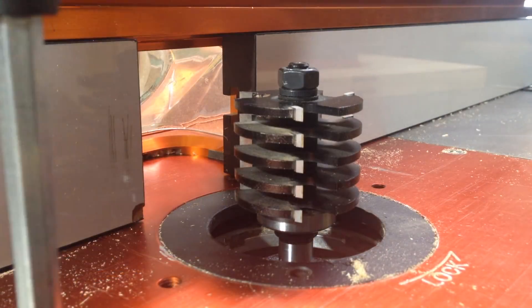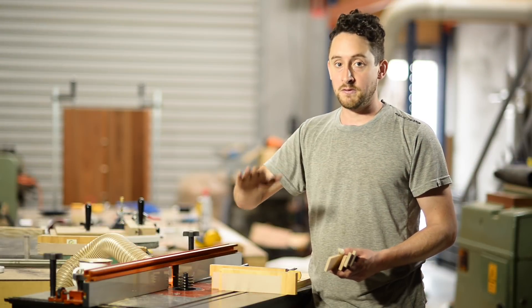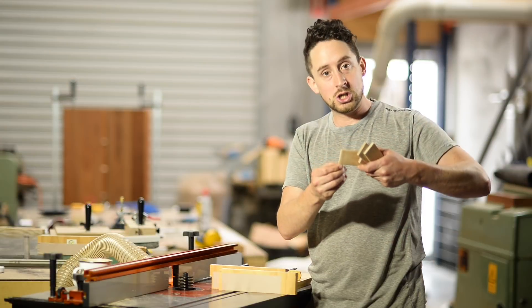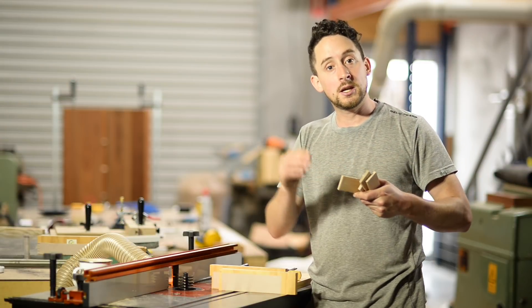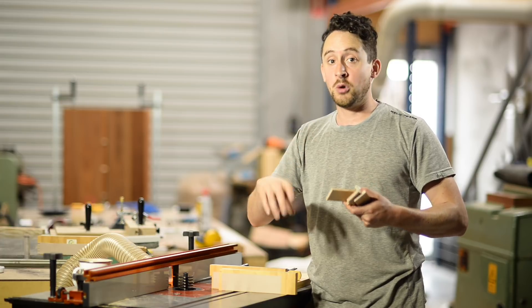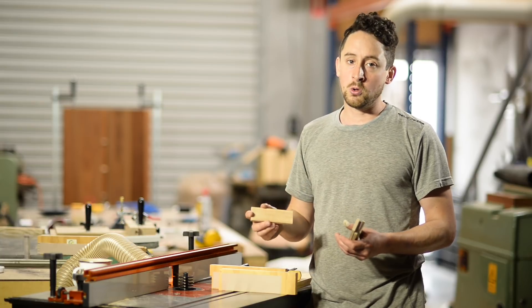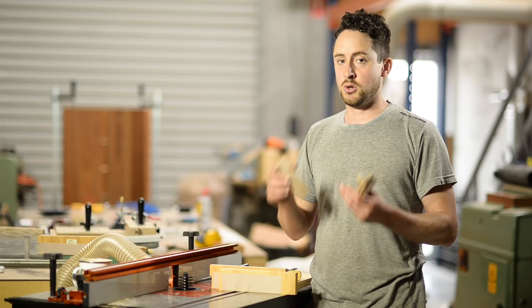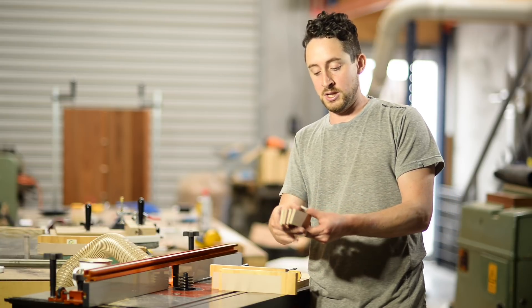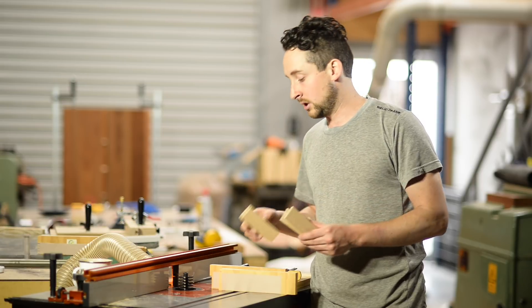Put the bit in the machine and I've dropped it down so that the bottom edge of the lowest blade is perfectly flush with the table — that's going to mean that our lowest notch is exactly four mil thick. If it's too high, your notch will be wider than four mil. If it's too low it'll be smaller — you need it to be precise. If you're doing a whole lot of stuff with really nice timber, it's worth doing a test cut.